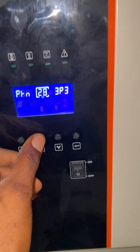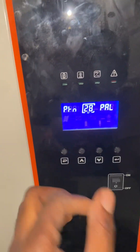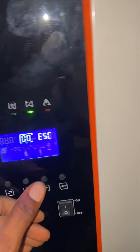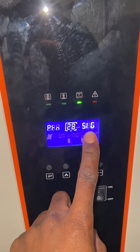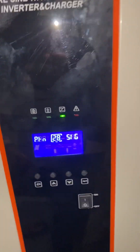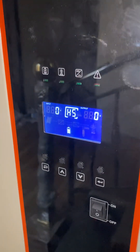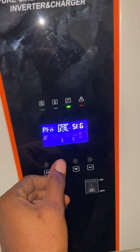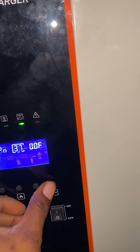I already switched off the switch. Then just press here — you see 'parallel'? Once you've seen P-A-L, that's parallel. You click here and it has confirmed. Come to this other inverter as well. You can see it's on single still. We're trying to set parallel here too. Once you set it, the screen will go off on its own. The one you set first is going to be the host.